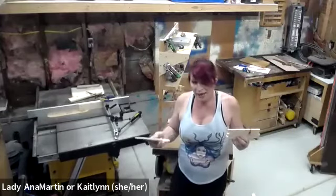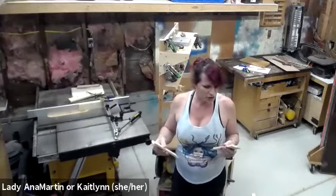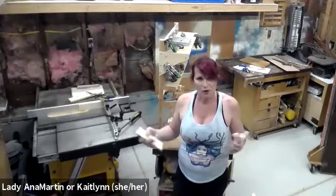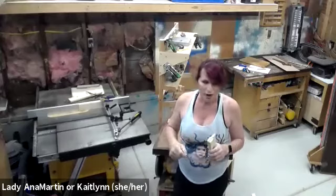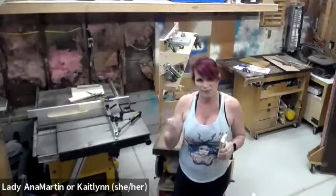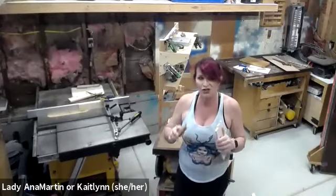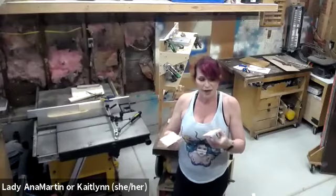Wood has end grain and face grain, also edge grain, but they're basically the same thing as face grain. Imagine a piece of wood as a big collection of straws all held together. So the ends of the straws are along the grain. And as you can imagine, those ends of the straws don't have a lot of surface area. So when you glue end grain to something, it's a very weak joint. When you glue end grain to face grain, it's still a very weak joint. It's only when you glue face grain to face grain that you have a strong joint.